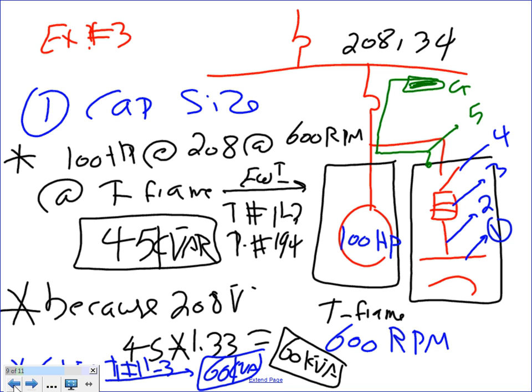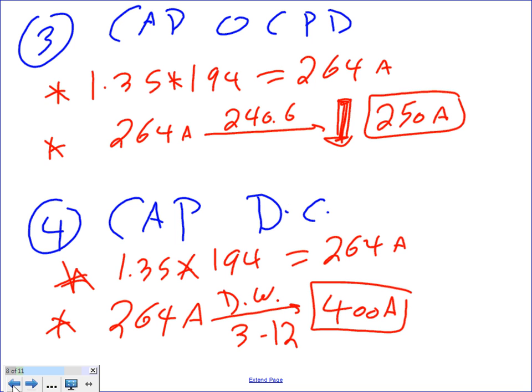So what you do is the first calculation that we did, guys, based on the amps and the voltage, find how many kVAR you want. Then there will be a table, I don't have it, that translates the kVAR you want to correct to a 90% power factor into an equivalent horsepower synchronous motor. That's when you pick up the phone and say, I need a synchronous motor at 480 volts that can give me 200 kVAR. The people who sell them have a sheet and tell you, 200 kVAR, no problem. Next, you're going to have, let's say, a 50 horsepower synchronous motor.